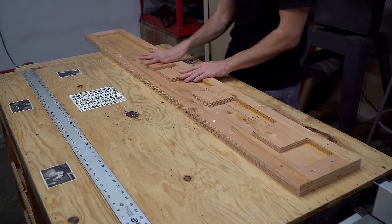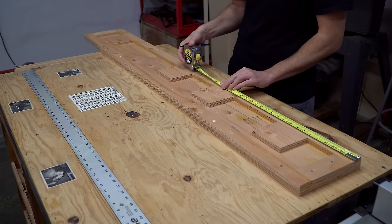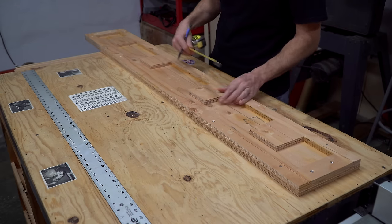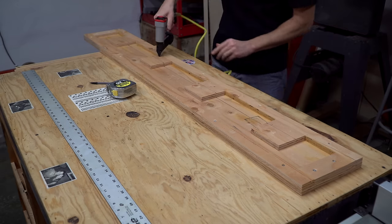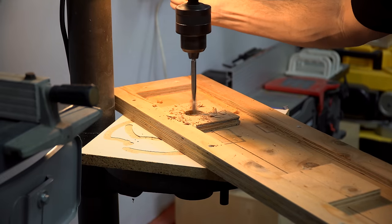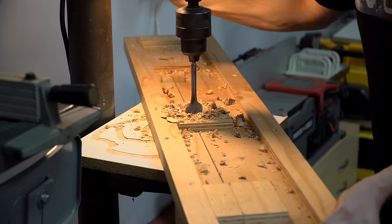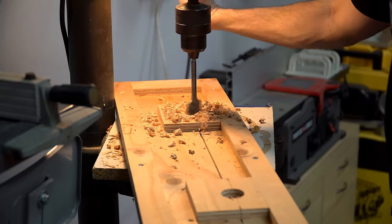Because the slot was already cut, there was no way to get a drill bit started in the center of that slot. So I temporarily pinned some blocks in place to give me something to let the drill bit get started. That said, if you make one of these, make sure you drill the holes before you cut the slot. When drilling this series of holes, be sure to use a large drill bit — at least one inch in diameter or more.